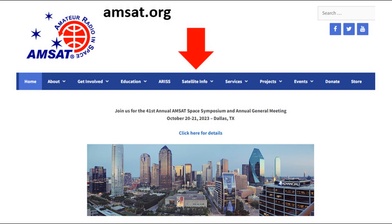But if you time it right, there could be occasions where you own a spot and there are several satellite passes you can take advantage of. For more information, go to AMSAT — that's AMSAT.org — and click on Satellite Info. That will tell you all you need to know about various amateur satellites, the ones that are active, and their frequencies. You need to set up your transceiver so that you can transmit and receive on the right frequencies, as well as subtone CTCSS. Along with the times for your location, you'll be able to get onto satellites and make contacts over quite long distances.